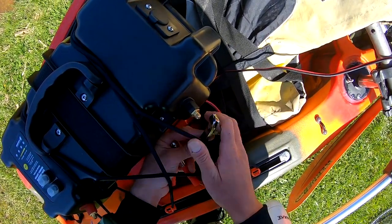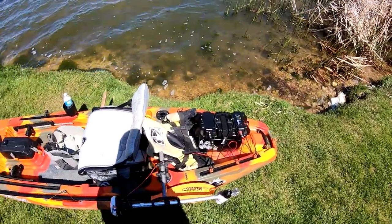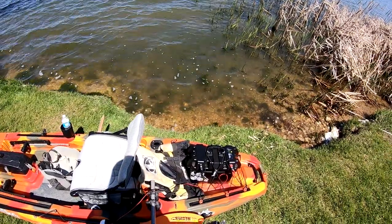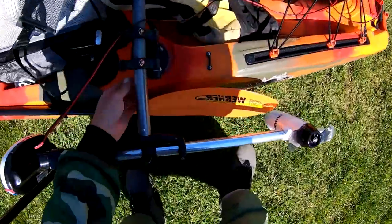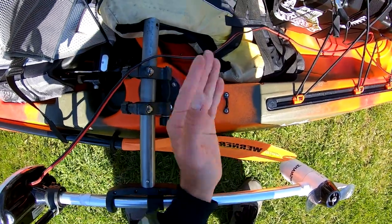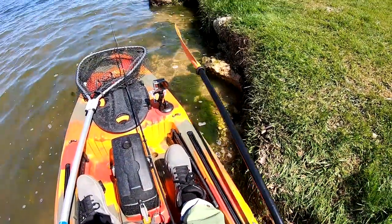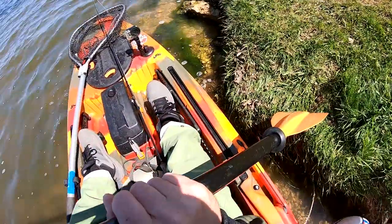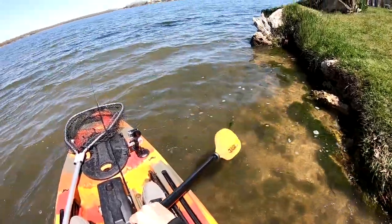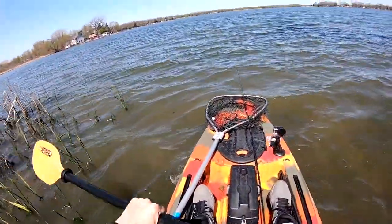The battery I'm using is a Lithium Pros TM2450. The motor is really easy to put on your kayak and take off — that's one main reason I bought it. These bottom knobs I tightened with some pliers so they're permanently tight and won't twist. These up here I hand-tighten. Now that we're in our kayak, we can push away from shore, drop the trolling motor in, and tighten it up so it's not going to turn when we run the motor.